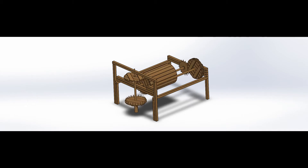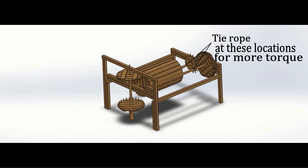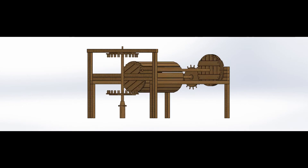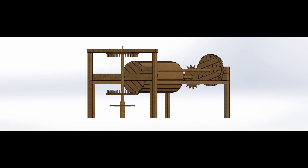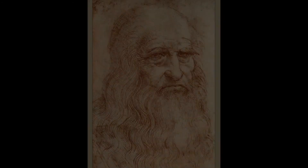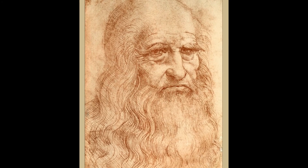But there were aspects of this design that Brunelleschi sought to improve. The first improvement was to allow the rope to be tied along the horizontal axle rather than the drum, in order to allow heavier loads to be lifted at lower speeds. Another improvement was to add a second gear on the vertical axle. When the vertical axle was raised, the top gear originally used to rotate the horizontal shaft would come out of mesh, and the second gear would now be in mesh, allowing the axle to rotate in the opposite direction without untying the oxen and turning them around. This invention would not have been known to us today if it weren't for Leonardo da Vinci, who documented Brunelleschi's designs.